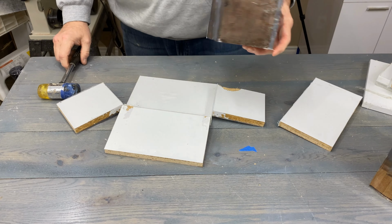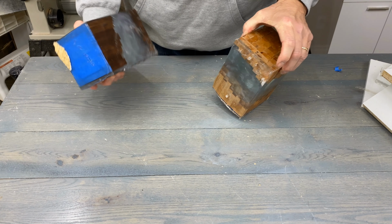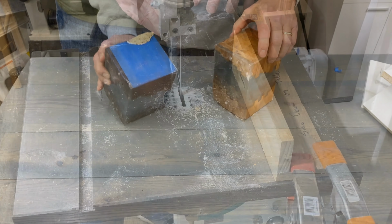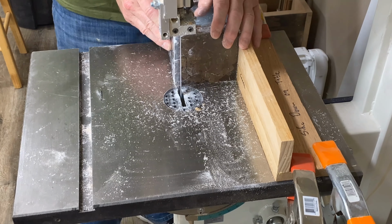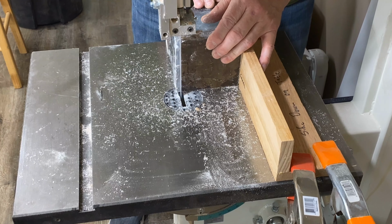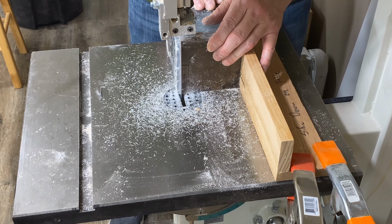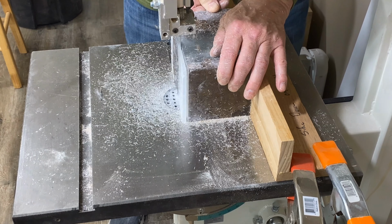Despite the expected drama, the woodblock sculptures actually released from the forms pretty cleanly. I can see a couple obvious bubble inclusions in the walnut pour, but the cherry wood piece actually looks pretty clean. The bandsaw will help remove the overpour and get me closer to the wood for final finishing. And then it's off to about a day of sanding through the grits.